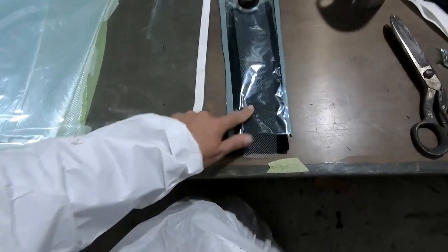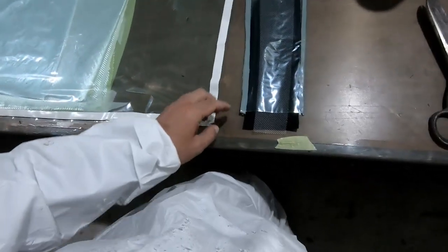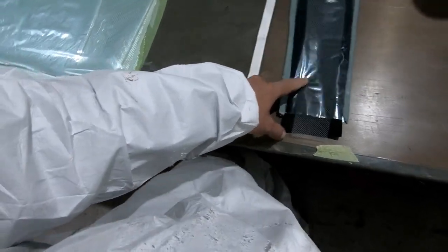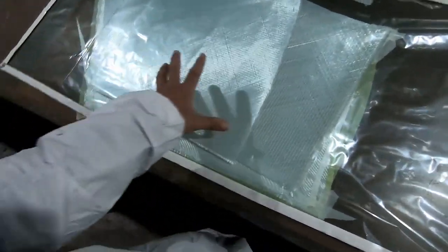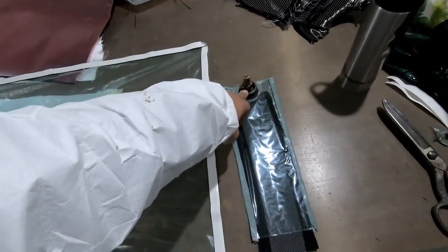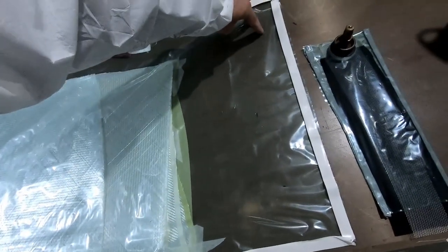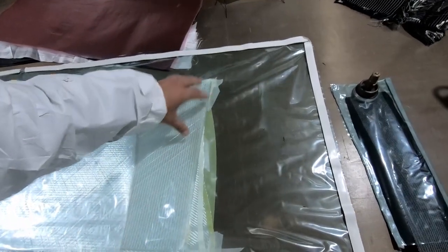Last but not least, the frog's tongue. If you're working on a flat table, like we are in this room, the importance of a frog tongue is a bit lower, because if I was laminating this bit of fiberglass here, I would have this bag oversized like you see, all the consumable stack, and then I would have the breech valve, which goes to the vacuum bag, stuck up in the corner a long way away from my resin, and I would have a bit of breather felt going to the job where the resin was.